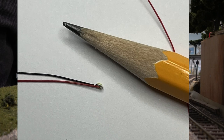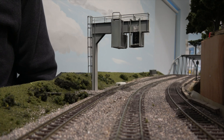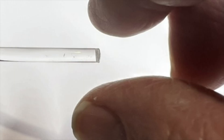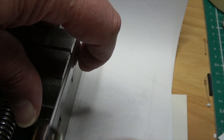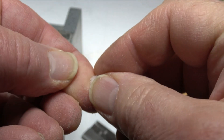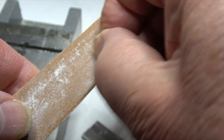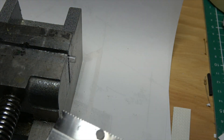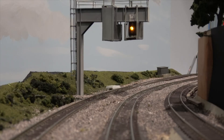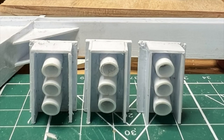The signals were built from pre-wired surface-mounted diodes — SMD LEDs — purchased from eBay in the appropriate colors. These were glued to thin slices of clear acrylic rod, rough sanded to act as light diffusion lenses. The acrylic discs with the LEDs attached were then glued into the tubes in which they were mounted.